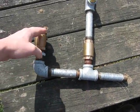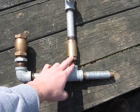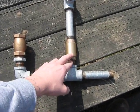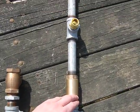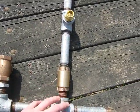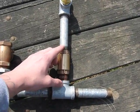The swing check slams shut, and that puts pressure in here from the water hammer coming in, and that opens this valve just for a little bit. There's a spring pushing down on a gate right here that holds this shut.